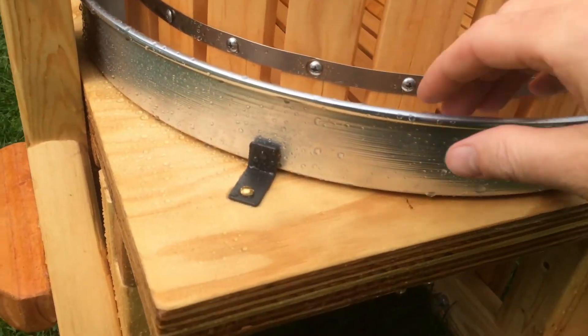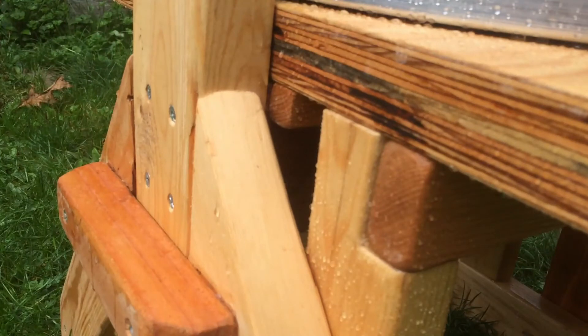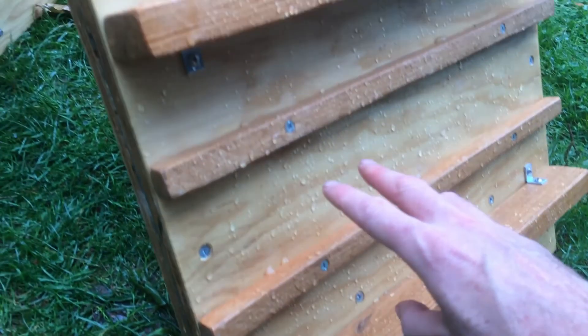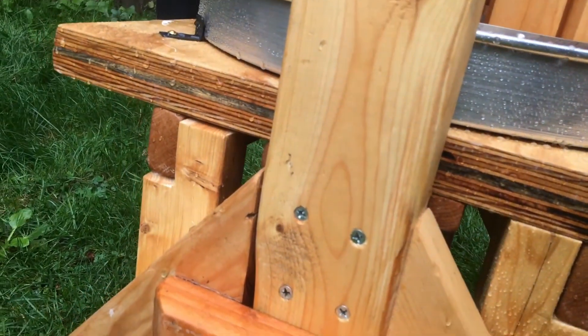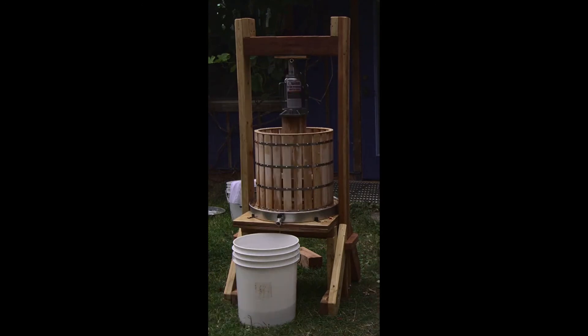The platform everything sits on is also double three-quarter-inch plywood, and it lifts off the frame with no attachments and just kind of slides out. The larger cross pieces are for structural support, whereas the smaller strips in the center are just located on the main press frame. The legs of the frame are totally removable by hand just by loosening these finger-tight bolts at the bottom. I added these vertical notched supports onto the legs after realizing that the platform was flexing way too much — even though it's double three-quarter-inch plywood, it was just bending like rubber once the pressure built up. There's really more flexing than I'm comfortable with; even the 4x4 at the top is bending. Eventually I'm just going to weld a metal frame onto the outside of the wooden frame to hold it more rigidly.